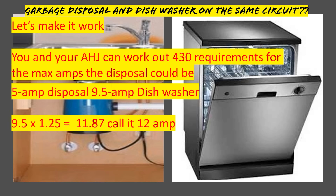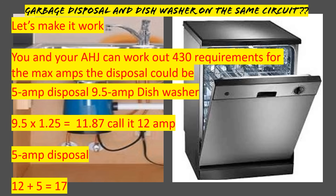Now there is no separate 80-rule concern as far as filling up the breaker — we've already fulfilled that in that code calculation. I have a video on my channel called 'The 80 Rule Explained' if you want to check it out. Technically we could fill a 20-amp breaker up to its full capacity. So we've done our 1.25 rule on the dishwasher; now we just add our 5-amp disposal, giving us approximately 17 amps total — with about 3 amps to spare.